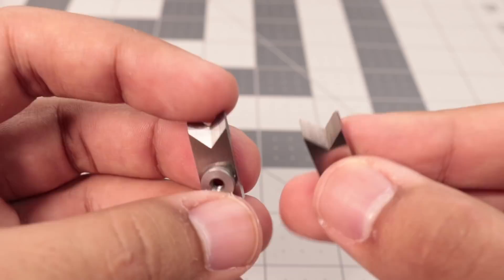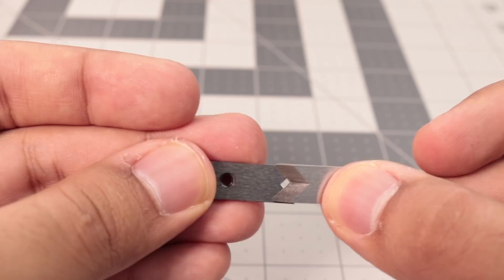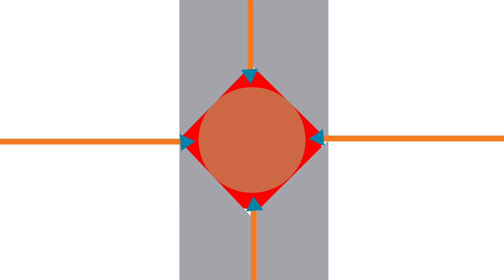I've picked up these 90-degree V blades, and they're very sharp. When you put them together with something between them, you can cut it. Because they're 90 degrees, we can't actually cut all the insulation off. Looking at a cross-section — a wire's cross-section is a circle, and these 90-degree V blades can only form a square. When we put that square around the circle, we can't contact the outer diameter completely to remove all the insulation. At best we can perfectly nick it, and if we go a little bit deeper, we've cut into the cross-section of the wire, which weakens it and kills its current carrying capacity.